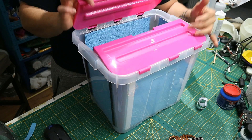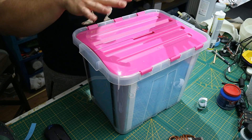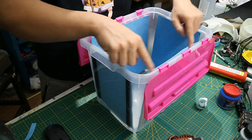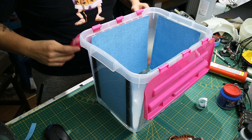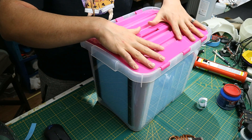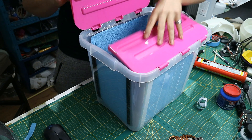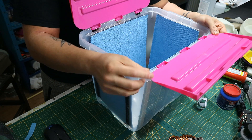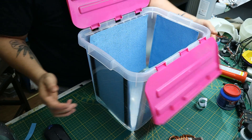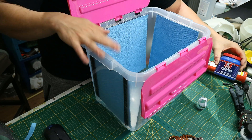The vapor could still escape because this is just a normal closing box and it's still open on all the lines. We are going to caulk it up, but before we start caulking, we need to close this up eventually — but if we do it prematurely the caulking would bond on the lid side too. So to prevent the two from sticking to each other, I'm going to smear Vaseline along the whole line so it won't stick to the caulking.